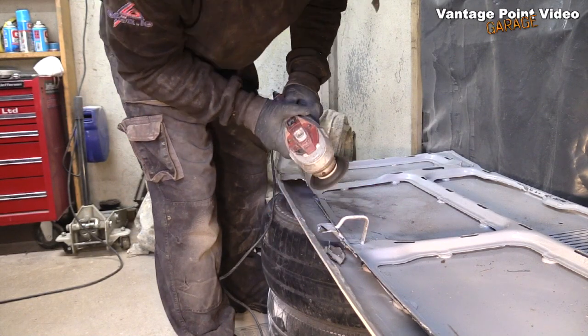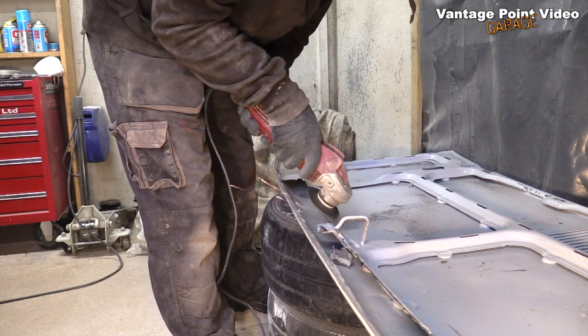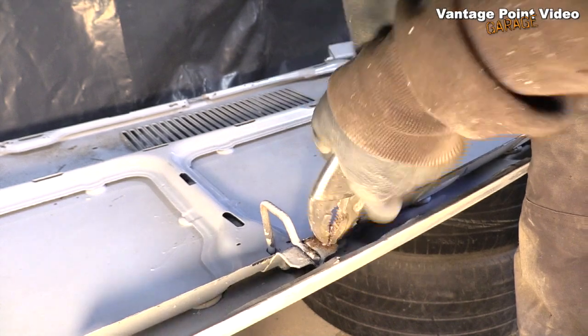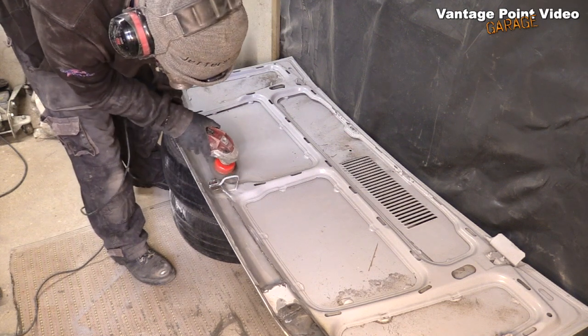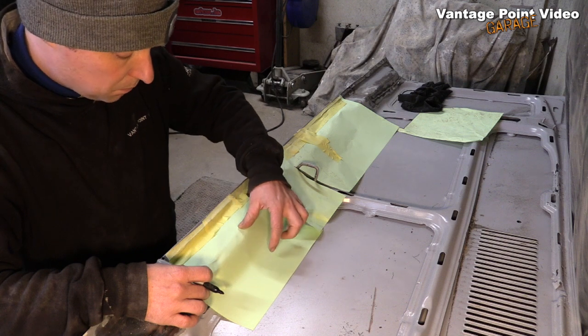There were 2 spot welds there near where the bonnet clasps shut. I ground them off and then continued cleaning off all my edges. One little bit to twist off. Then I wire wheeled back all the paint so I wouldn't be causing too much burning. Then I welded along here.